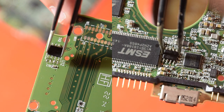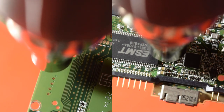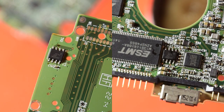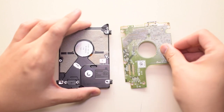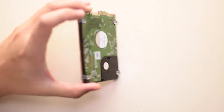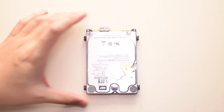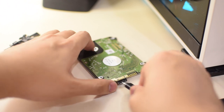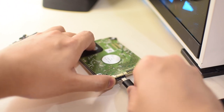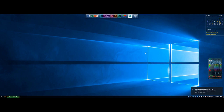A bit of flux always helps. Go ahead and solder the original BIOS chips back onto the donor board, then screw the PCB back onto the hard drive — and we're done! All that's left is to test if our operation was successful, and voilà — we've successfully managed to revive this hard drive.